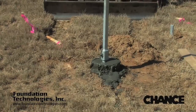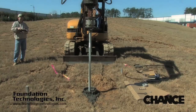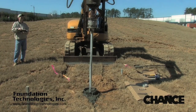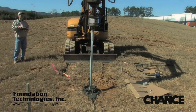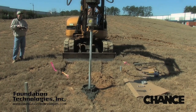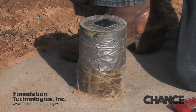Prior to reaching the maximum torque capacity of the shaft material, you'll begin to see a permanent twist or wrap in the steel. This is normal and does not damage the steel. Shaft twist or wrap is a good visual indicator of installation torque. The shaft steel can then be cut off with a portable bandsaw to the proper termination grade.